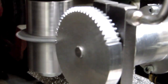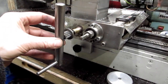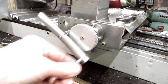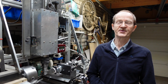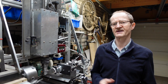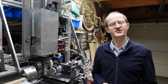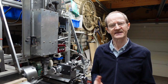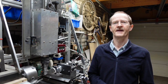With this setup I am now able to make all kinds of gears. As a first project I made a 58 teeth gear from aluminium to replace the plastic gear of my lathe cross slide movement. The aluminium gear is more robust and the operation is very smooth. I hope you liked this video. You can also make digital divider heads by using stepper motors, which don't suffer from the backlash issue. But I found this DC motor with a large gearbox and with some tricks the divider function is quite okay. I have posted the CAD files, schematics, component links and the Arduino program on my website. Please see the link in the description below for more information. Thanks for watching.